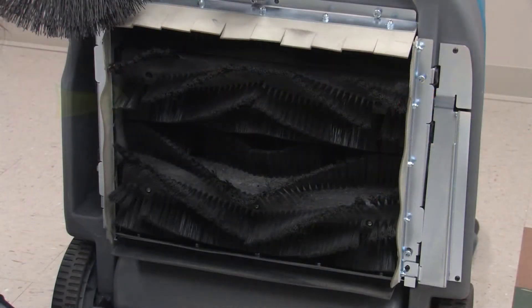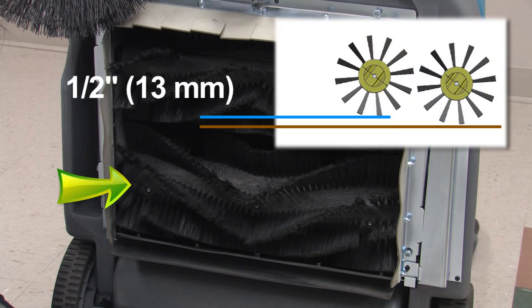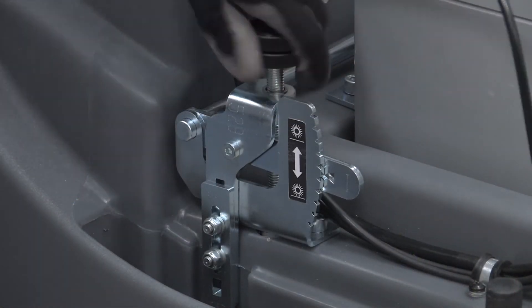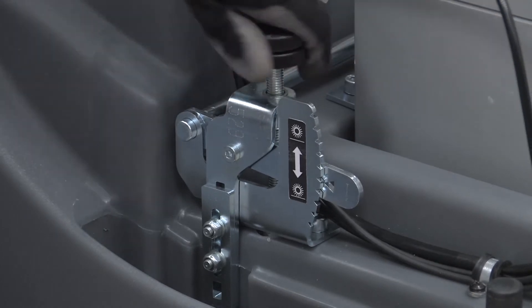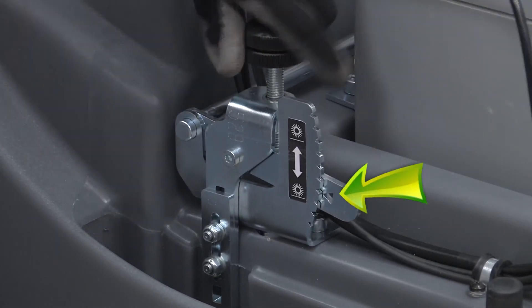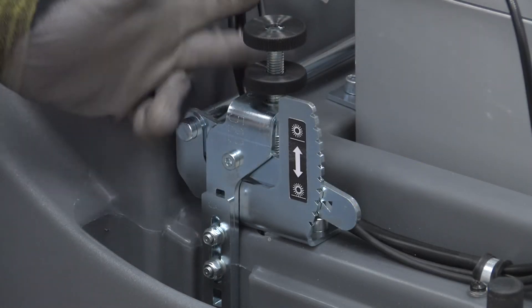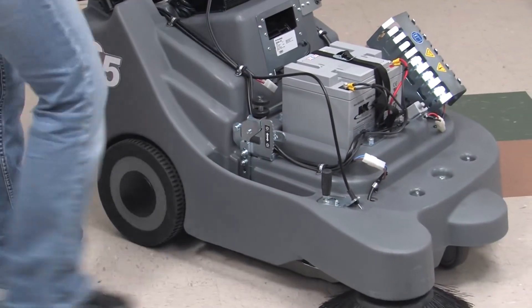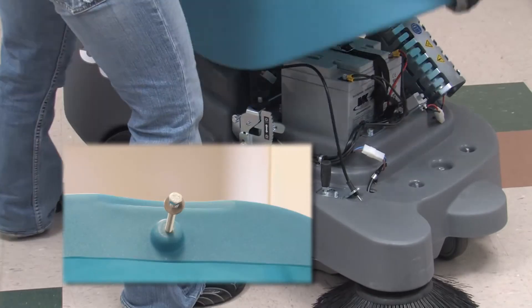The front brush is stationary with a setting even with the floor. The rear brush should be adjusted to have approximately one half inch of bristles in contact with the floor. When a new rear brush is installed, the brush pressure adjustment mechanism should be set to the sixth or seventh brush adjustment notch from the top. Once adjusted, lower the thumb nut and tighten it to lock the adjustment mechanism in place. Then lower the cover and reinstall the cover retaining bolt.